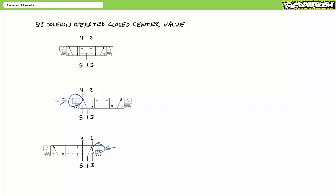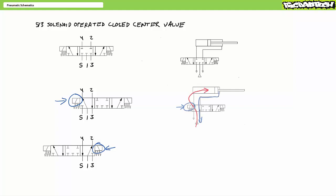Conversely, when solenoid one two on the right hand side is energized, the valve moves into a position that passes supply one to actuator port two, blocks exhaust port three, and vents actuator port four to exhaust port five. You might use a five by three directional control valve with a closed center to operate a double acting cylinder that needs to be paused and locked mid stroke. Lacking any electrical signal to either solenoid, the cylinder is locked in place. When solenoid one four is energized, the cylinder extends; when solenoid one two is energized, the cylinder retracts.